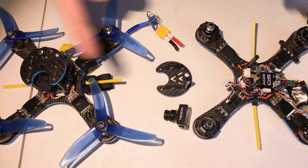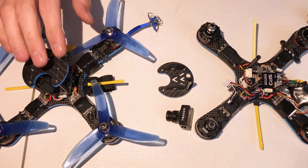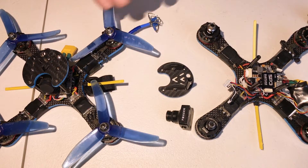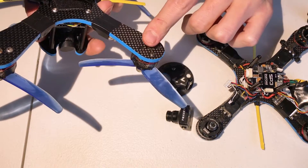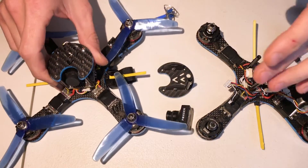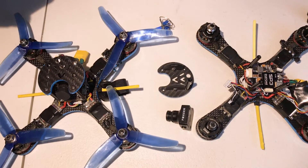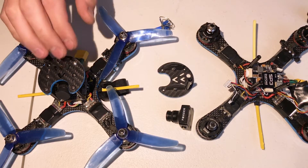I'm going to switch these cameras, and there's actually an issue with this other quadcopter that we're going to go over as well. I'm also having video issues on this one. The other day it was flying fine until motor screws came loose and the motor was flapping around. After a couple of crashes, I was getting very bad banding whenever I hit the throttle — so bad that I almost had to float through the track when racing. We're going to go ahead and troubleshoot this one as well.